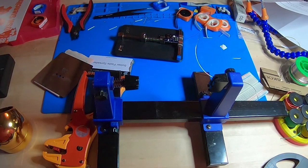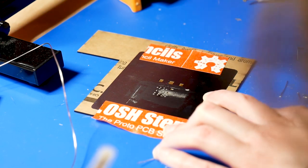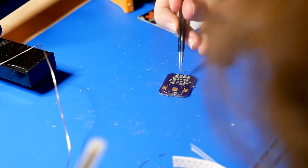Now let's talk reflow. For the benefit of those watching who might not be fully up on electronics — shout out to my in-real-life friends who watch to be supportive, love you — let's do a high-level overview of what reflow is. Hot air reflow is the process of assembling a circuit board with hot air that affects the solder paste. Instead of using a spool of solder and your handheld iron, you use this paste kind of gunk that gets applied with a stencil over the board. So everywhere where you'd normally do a hand joint, you are basically putting this paste. You then place the components either by hand or using a pick-and-place machine — that's this big robot that spits out little bits. And then when heat is applied, the paste reflows just like when you melt the solder with your iron and the circuit board is assembled. It's really efficient and awesome. This is how large-scale manufacturing of PCBs works. Everything from your phone to your Nintendo Switch — it's all reflowed, they push them through these ovens.